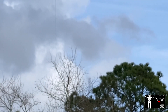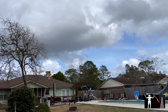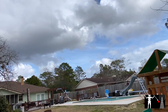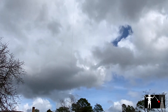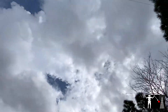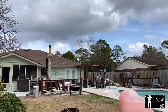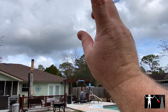You can see it going over that treetop. I cut it at 140 feet and it stops about 30 feet in front of that tree. I have it rigged as an inverted L off of that tree, coming from the ground up and over — over our heads this way.